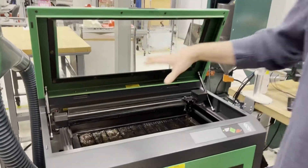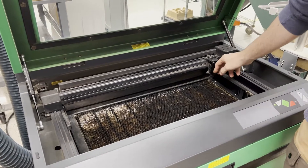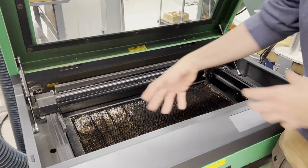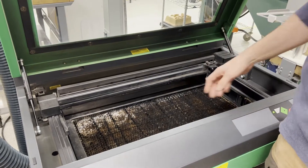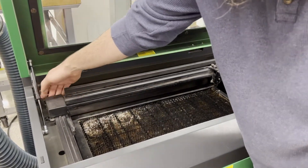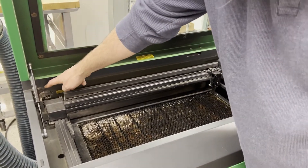This is a lot smaller of a machine, meaning it needs a lot less draw to get all the particulate out. The area above the laser head has a little bit of positive pressure coming out of that hole, so any particulate being thrown around while things are engraving or cutting is not allowed to go into that area. And then at the mirror under this little cover, I can put my finger here and feel a little bit of positive pressure coming out — and the same thing with this port where the lens or mirror is behind it as well.